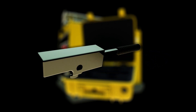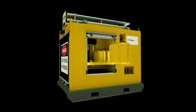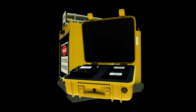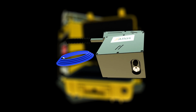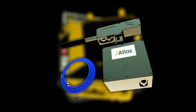Wireless displacement sensors record pile settlement and reaction uplift. Rotation sensors record the performance of the reaction frame or Kentledge. The wireless load cell sensors record direct load to the pile and transmit data eight times every second.